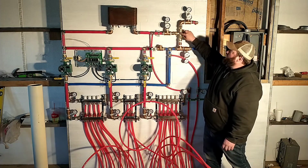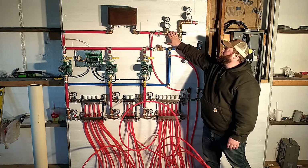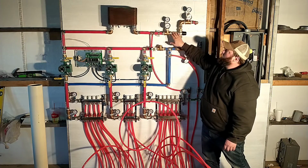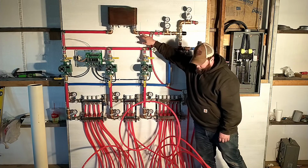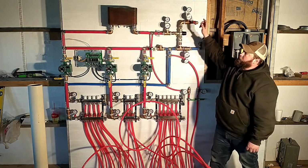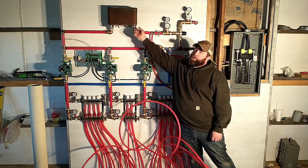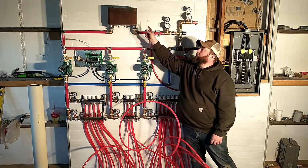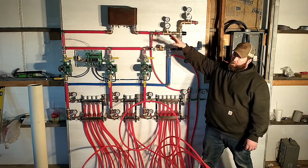But it takes this hot water in, and we'll mix cold water with it to make whatever temperature of output water that I need. So we'll have hot water coming out through here. We'll ignore this for the moment. We'll come through here, go into the heat exchanger, and then back out. The heat exchanger, I will plumb a potable water connection in here and then out there. And what that will do is it will heat my incoming water as it goes into my hot water heater.